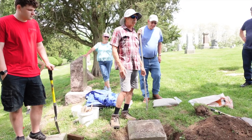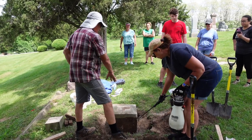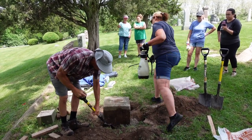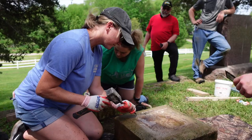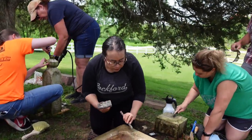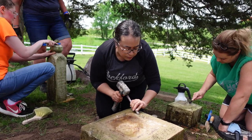In modern installations, usually only about an inch or two go in the ground, and most of the base goes out of the ground. The next thing we're gonna have to do is clean the base and all the pieces to reconstruct it anyway. Now I'm gonna go just pack it in really as well as I can. The better the compaction, the longer this will last. So a lot of the time and the work is involved in two things: getting the bases elevated, level, regraded, and then prepped.